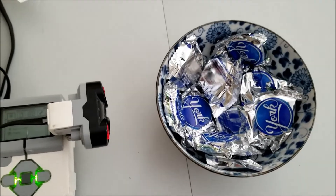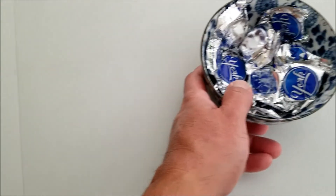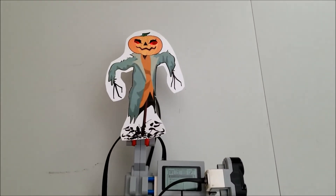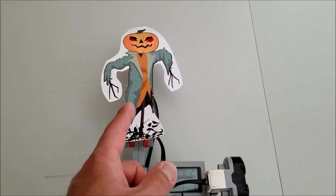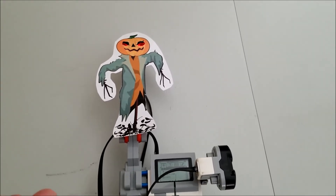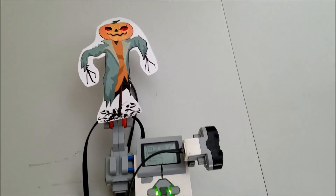Here's how this is supposed to work. I have two ultrasonic sensors — one just looks scary, but this is the one that's actually going to detect somebody trying to reach for the candy. I'm not sure if this candy is too high, but you can always raise this up. When somebody tries to take the candy, it's going to activate the ultrasonic sensor, which will cause this large motor to make the scarecrow pop up. And I actually recorded a sound for it to play a sound file.